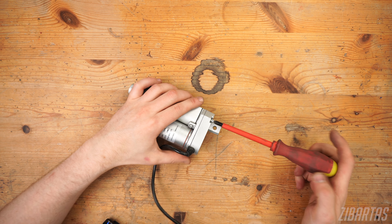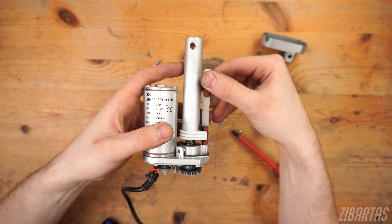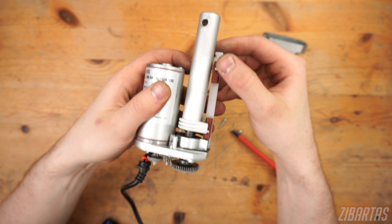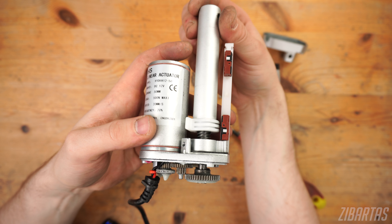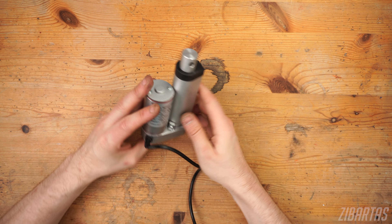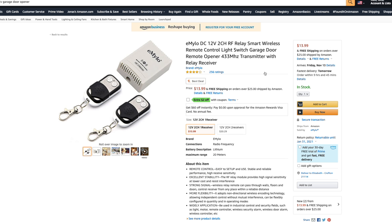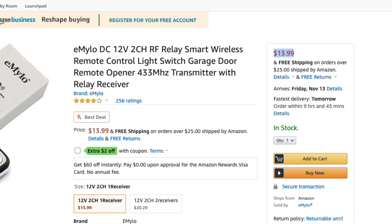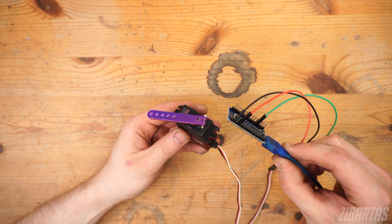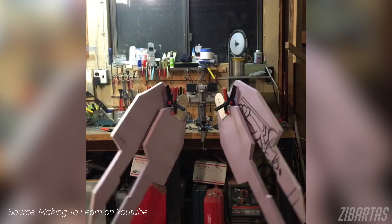Under the hood, a linear actuator is just a motor that will move a cylinder between two limit switches. Once it reaches either of the limit switches, it will stop moving until you reverse the direction. This really simplifies the electronics needed. Even the most fancy wings use stuff like off-the-shelf cheapo garage door openers and other similar controllers, so there's basically zero electronics work if you go that route. Servos, on the other hand, will require an Arduino or something, but their compact size and power-to-weight ratio is very appealing for some designs too.